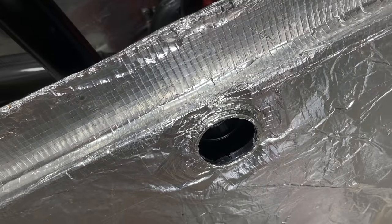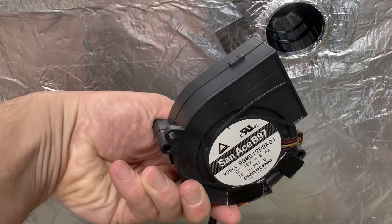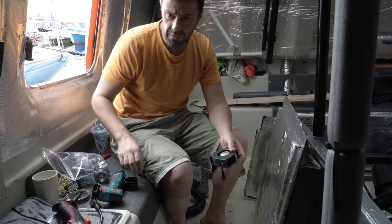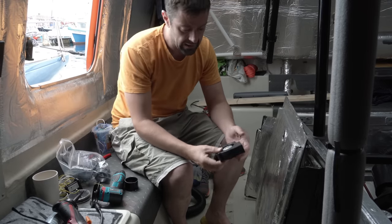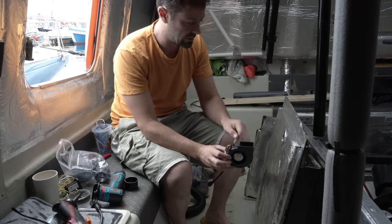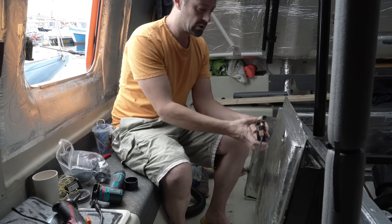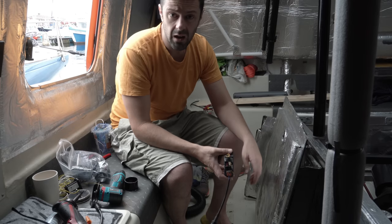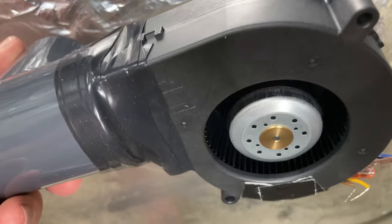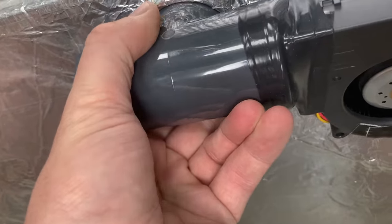The fan near the exit does need some help, so I've got a vastly more powerful 12 volt unit to blow air from the entrance end, and I've wired it up pretty straightforwardly. I'm trying to manage that age-old task of fitting a square peg in a round hole, so luckily I've got all sorts of little off cuts and adapters from the main ducting work. I'm going to try and find a way of mounting this here, allowing the air to come out of that rectangular output port and into that circular duct. I went with the right angle plan as its lower profile, and self-fusing silicone tape has made a reasonable job of the change in shape. I'll secure it using friction fit into the circular fitting and then velcro for the fan onto the cowling surface.